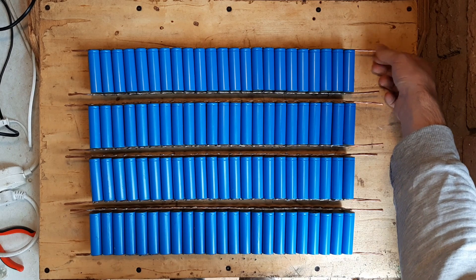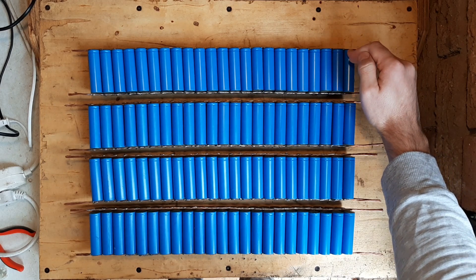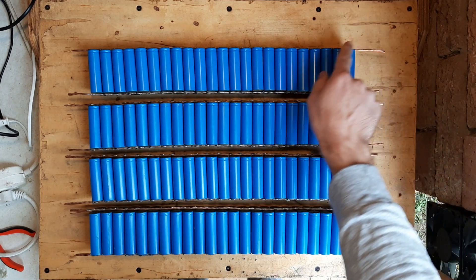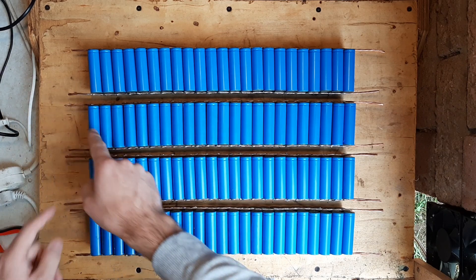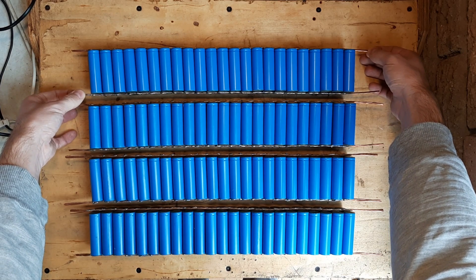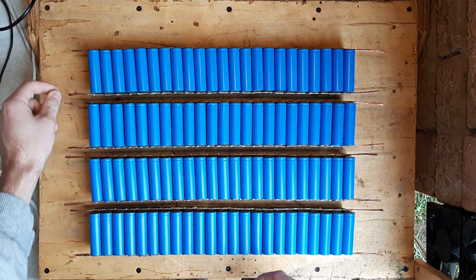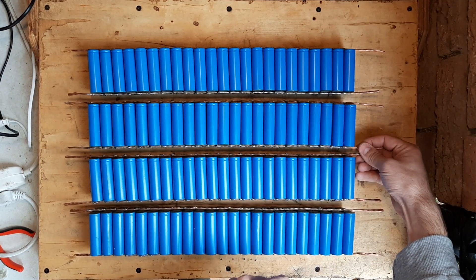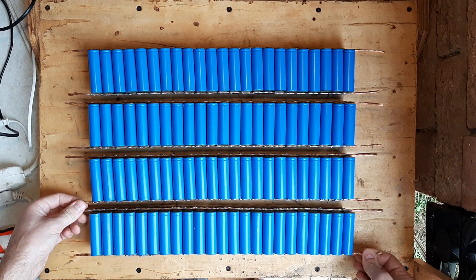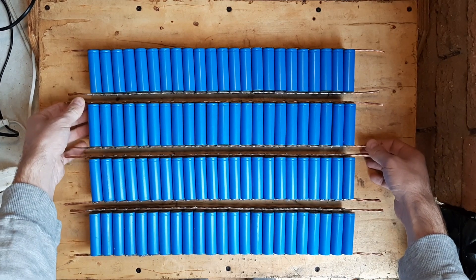What would be most ideal: let's call this the most positive point of the pack and this the most negative point of the pack. The positive connection will be here, and the other negative connection will be here on this side. So for each of these cells from here to here, the total copper cable is roughly the same — close to exactly the same — for each of these packs. Then we connect on this side and on this side, and then again on this side and another connection on this end. This will allow the current to flow evenly through all of the packs.